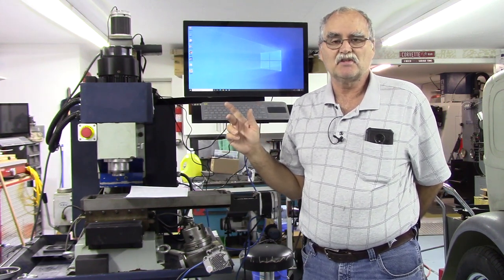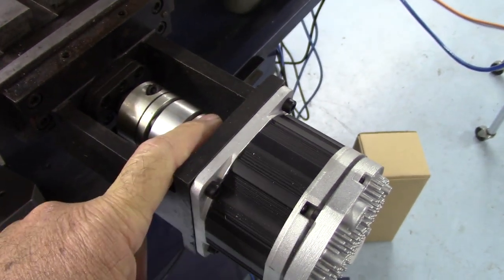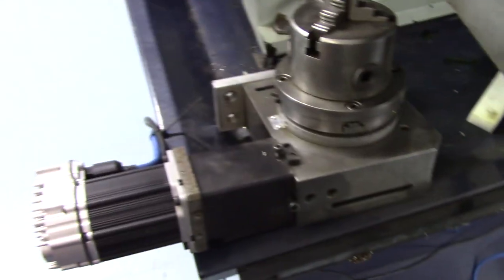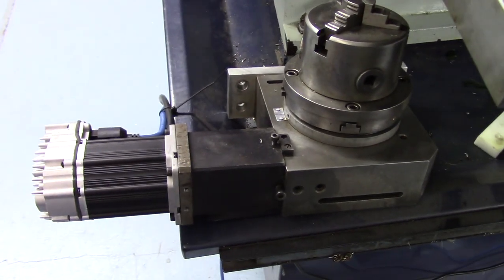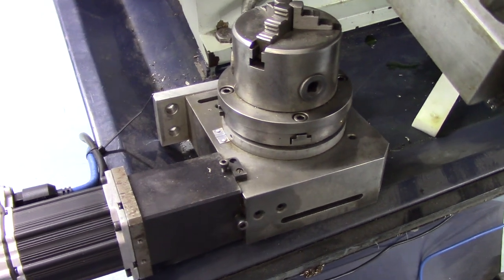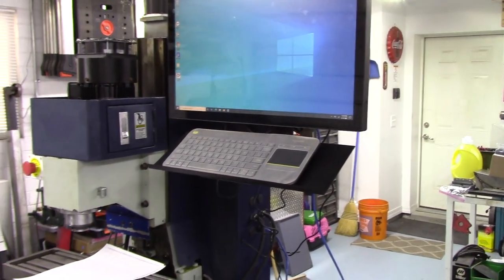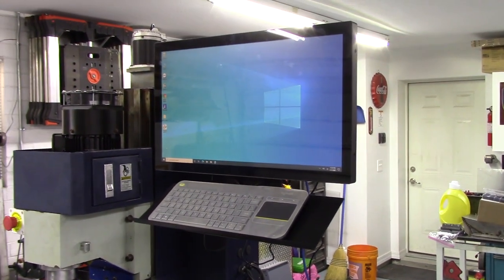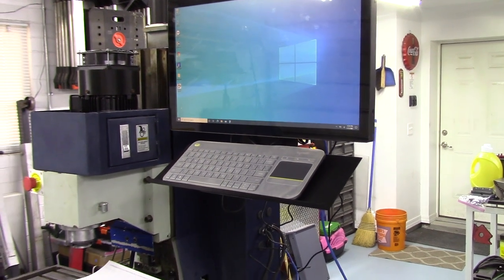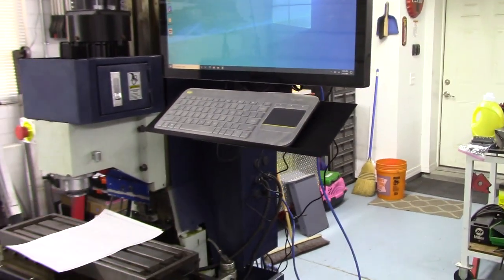Here's a look at the X-axis servo. I ordered the motors with the shaft made up to the coupler - these were NEMA 34 motors, the old steppers were NEMA 34 so it was a direct bolt-on. There is the A-axis fourth axis with its little NEMA 23 motor, again direct bolt-up, the shaft was quarter inch and the coupler was quarter inch. A lot of people are interested in the monitor mount and keyboard mount - I make these, they're very simple sheet metal. I had a touchscreen monitor so I went with that, and I use Logitech K400 Plus keyboards, which are meant for home theaters but they're inexpensive.